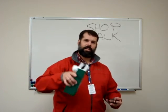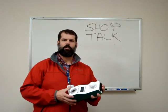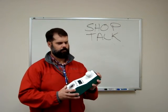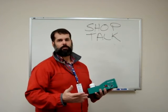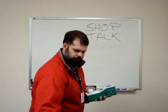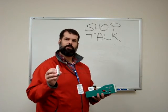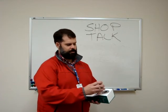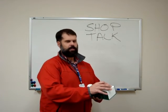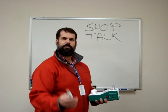Slide the battery holster into the front of the TetraCal — you'll hear an audible click and it's in. Then select the venturi you need for the proper flow. The kit comes with three venturis, usually labeled one, two, and three. The number one venturi, which we'll be using today, is used for anywhere between 6 to 30 liters per minute. Go ahead and slide that in firmly.